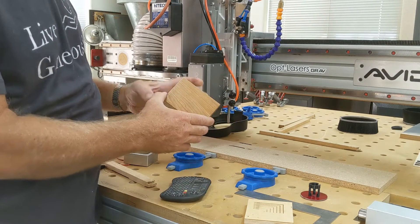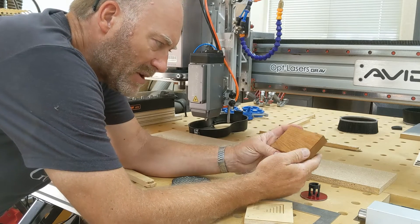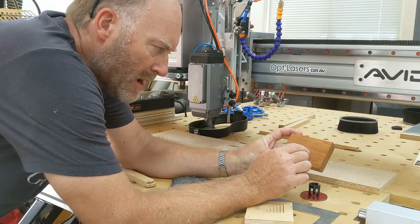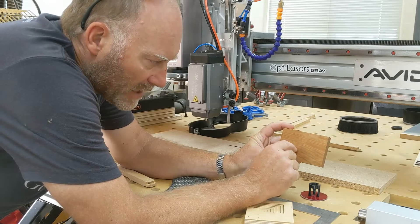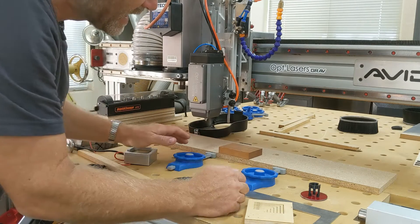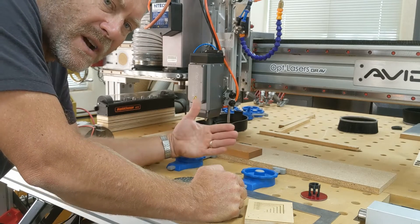So this piece of cherry — I'm just going to engrave the word 'cherry' on here. I'm doing some tests of the laser, how deep it'll engrave, and what kind of speeds and power levels I want to use. I've designed the image I'm going to burn with the center of it being my X/Y zero, so I put a really light little X on there and that's what I'm going to use to set up my X and Y. I've placed it on top of this piece of wood that I know is square to my X and Y directions.